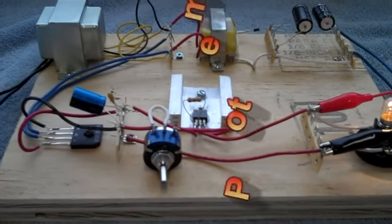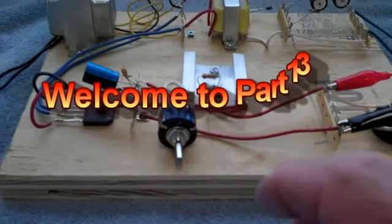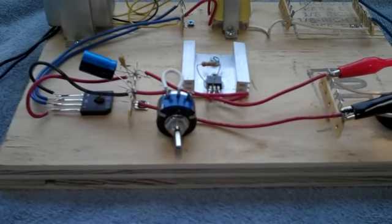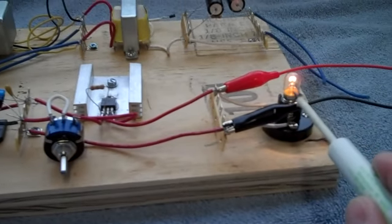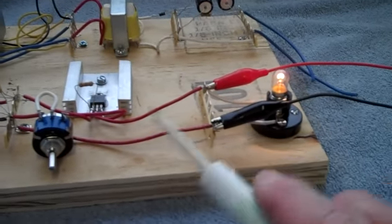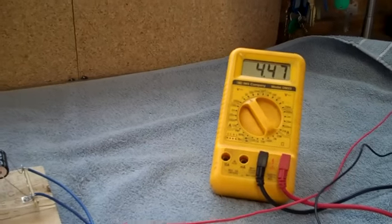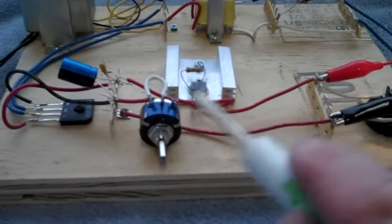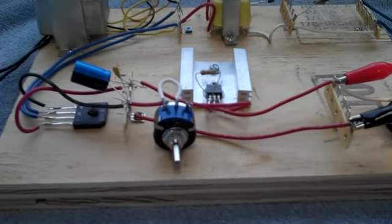We're getting ready to hook this power supply up to the radio — I'll do that in the next segment. But first, we still have to remove the wire-wound potentiometer we used to get the required resistance to achieve around four and a half volts out here. Let's see if we're still holding there at around four and a half volts. 4.47. Good. So I'll go ahead and remove that. We read the resistance earlier, and it was 173 ohms, I think. Let's shut it down and check it one more time.